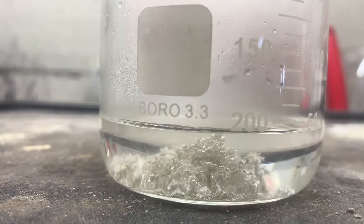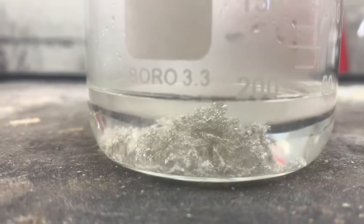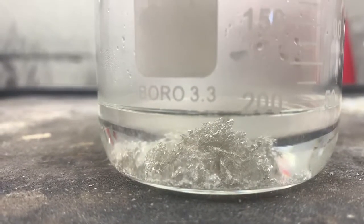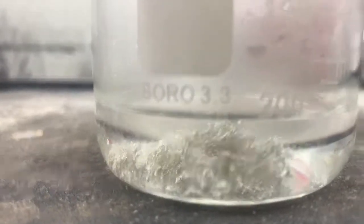This particular silver has been run through the silver cell twice, so it's probably better than three nines fine, but we're going to check and make sure. We've got some red mist forming in there, which is normal. What we're looking at is the liquid, so once this gets dissolved I'll be back with you.